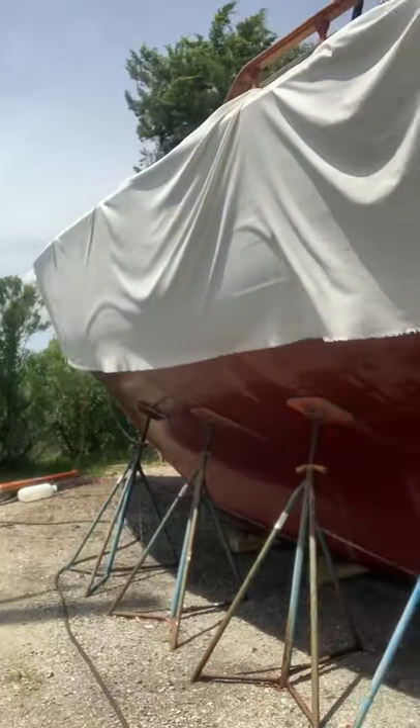All right, it's all done. You can see it's tied on here — good as used. So why I did this: this is a wooden boat, and because of that it tends to dry out on the hard because it's not in the water. That can cause leaks and seam separation. So this is heavy cotton canvas, which holds moisture. The idea is I'll use this hose, spray it a couple times a day, and it'll keep the hull moist.